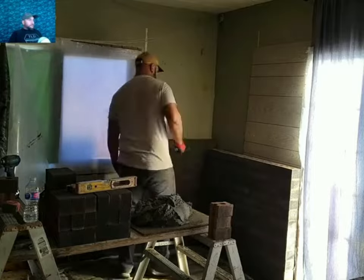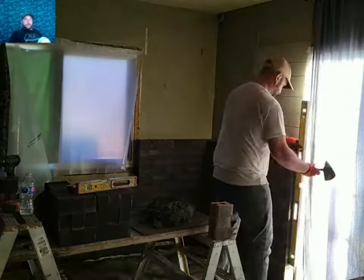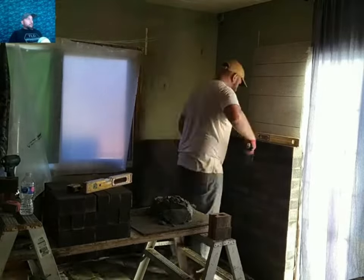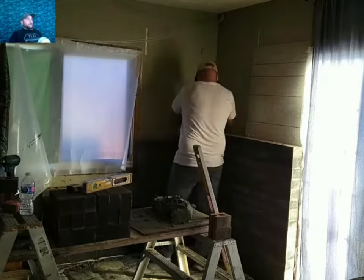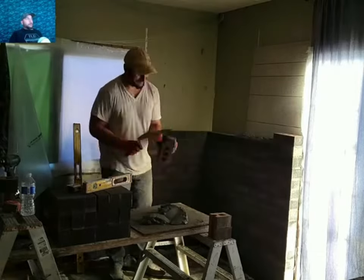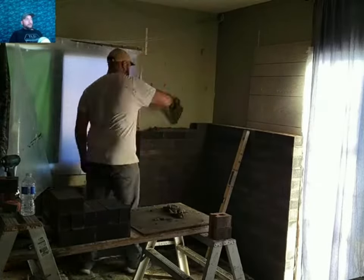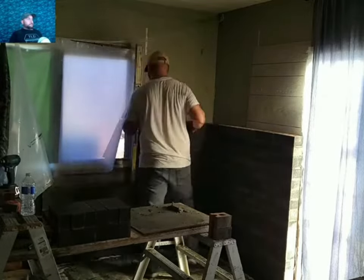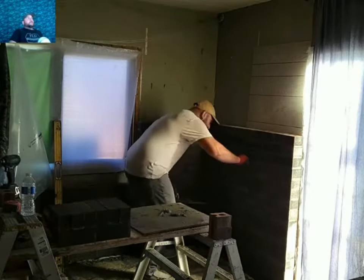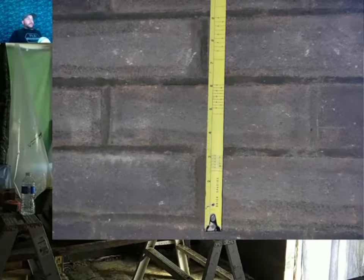Unfortunately I bumped the terminal for my light so it gets a little dark for a second. You can see me going around the window — I left a few bricks out and I'm going to install roll locks here. There's a special way you do the end roll lock so it doesn't have that edge with holes in it. A roll lock is essentially just a brick cut in half, laid on its side, that gives you a sill.